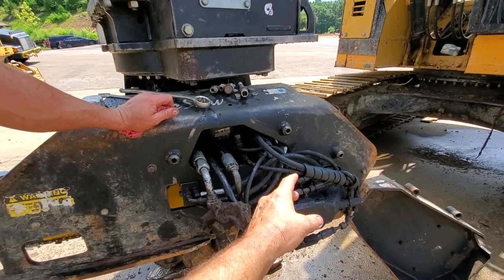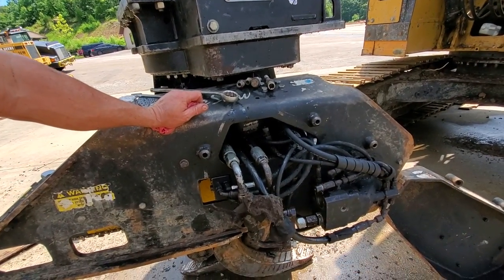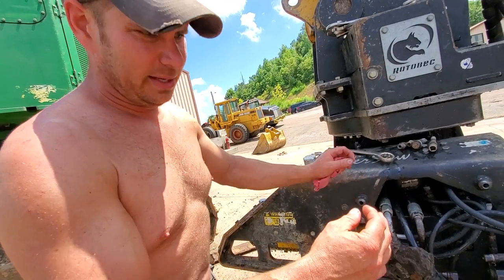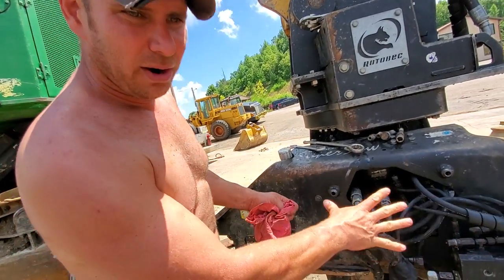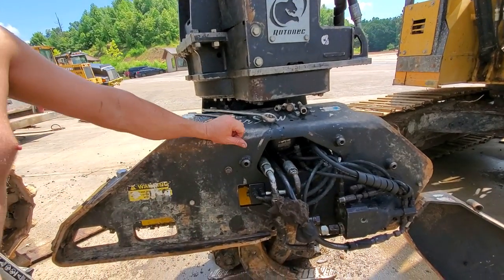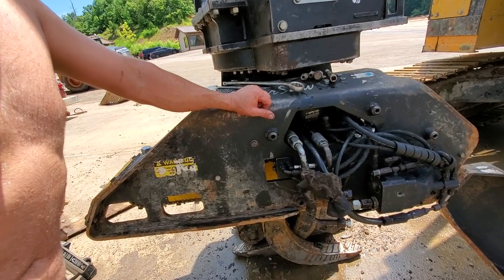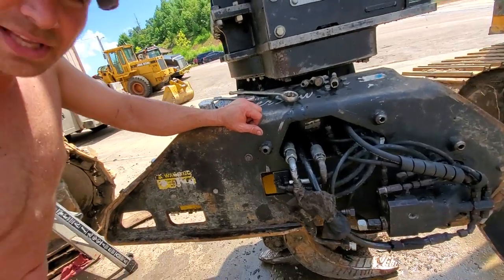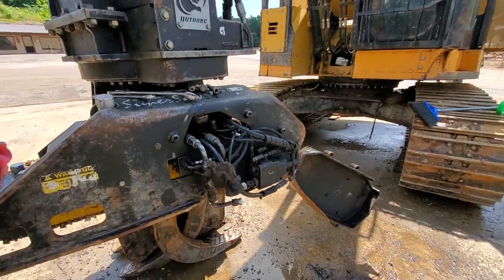By doing all that, he's come up with this hillbilly method of just sticking washers in to choke it down - adding pressure back here and up there for your bar, chain speed, and tensioner. Through the hillbilly method it can move and over-choke. Right now it's actually over-choked and the bar is feeding faster than the chain is spinning. The bar is putting more pressure down than what the chain can handle, so with a stock chain it just instantly hangs the saw.